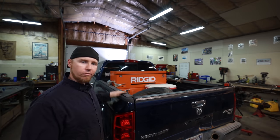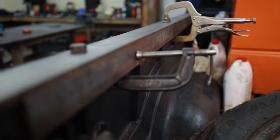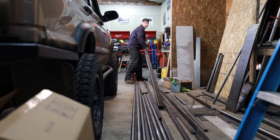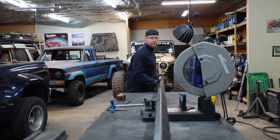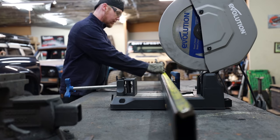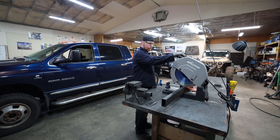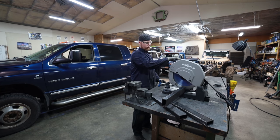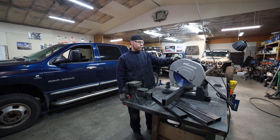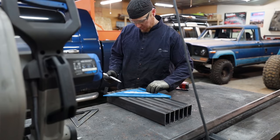You can use whatever you want — you can use flat bar — but I think angle iron is the way to go. I clamped everything straight just to make sure that as I was drilling, nothing moved around on me. Now we have a great foundation to start with. The next step is going to be a little bit more complicated. This bed rack is going to be a two-piece design: a main piece that will mount directly to the bed, and a smaller piece that will mount to the main piece and actually hold the rooftop tent in place. All the crucial points of this frame are going to be made out of 3 inch by inch and a half rectangular tubing. This is way overkill to hold a 150 pound tent, but that gives us a lot of flexibility in the future if I choose to put something heavier up there.